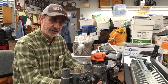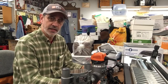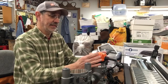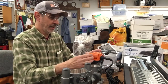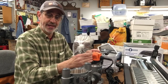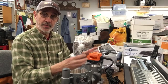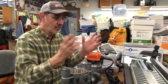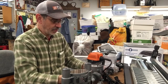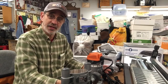I had it for about six, seven, eight years. I was doing a job with it and all of a sudden it just made the worst noise you could ever think of. The armature — up at the top where the brushes ride — the little brass fins that the wires on the armature are soldered to just started flying off for no reason. I've never had an armature fly apart on me.